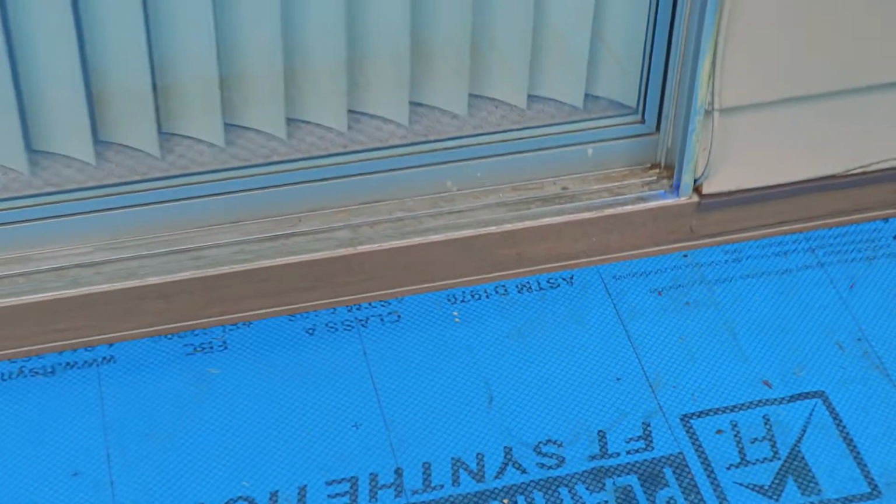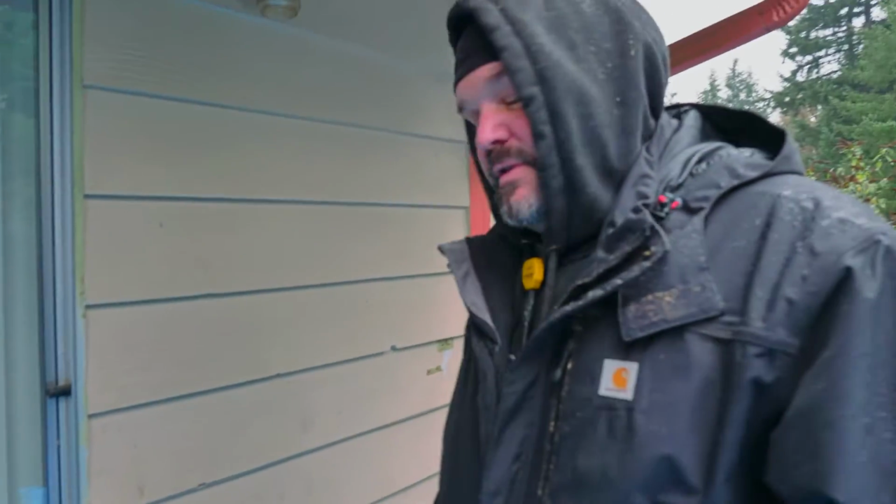All right, so now we have our freeze board installed. All our flashing is installed. Everything's nice and tight up against this door. Everything looks really good. We can start putting in our first piece of AZEK decking with the drdecks waterproof gutter spline in it. And then once we get that, we'll just keep adding and adding and adding, and try to get this deck laid today.